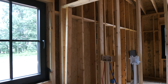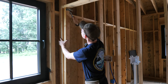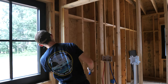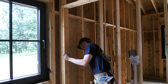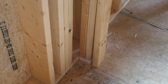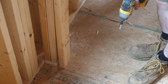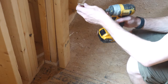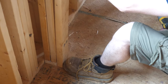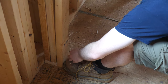Luckily this is a pretty sturdy end wall that I'm putting this up against. Should be able to straighten it out when I screw it all together. Luckily this stud is just bowed, which is pretty much the easiest defect to fix in a situation like this. I'm going to start down where the bow is the worst, screw this thing on, and then use the board's leverage to straighten itself out after I've got the bottom part fastened.